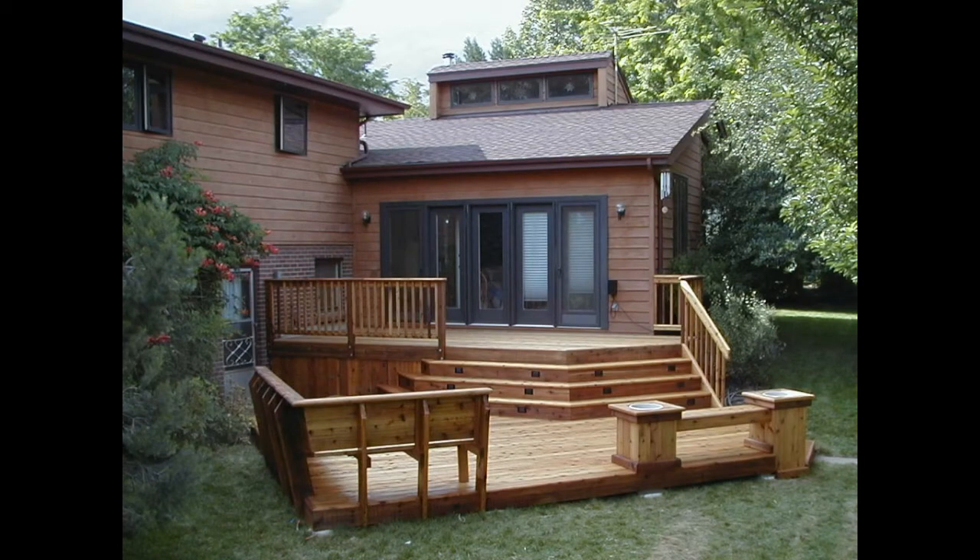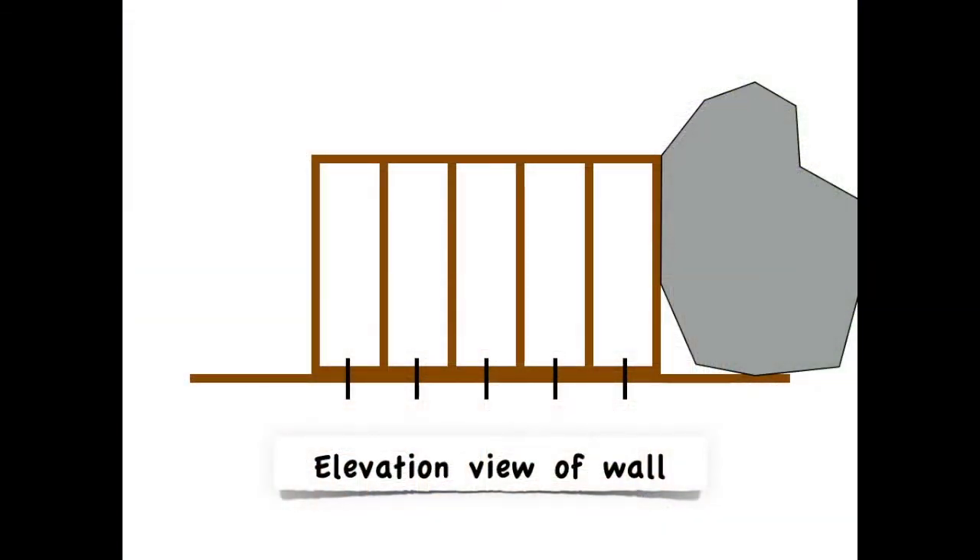But what if it's just one inside corner like this? Well, now it's more like a deck with one boulder. And these sides pointing toward the ledger — just the same way they're not going to move, this outer side moving toward this boulder is also not going to move. We'll talk in the next session about movement away from the boulder and how bracing can be achieved in this example, but we would want our connection maybe in a different place.